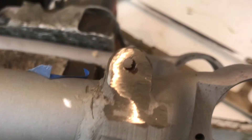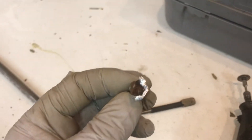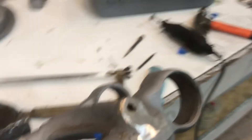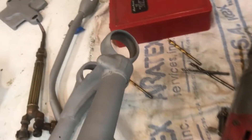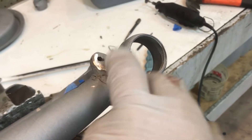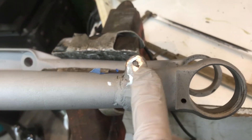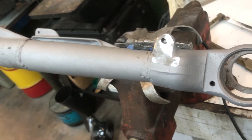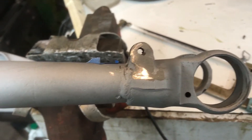There you have it — this is the end of the drill that was stuck in the casting. I went ahead and punched it out. And here was the bolt that was actually welded to the head. We got that ground down and it's basically in the proper shape — and I know it's the proper shape because I have the other swing arm sitting right here for reference. So what I'll do is clean this up, drill out all the rust in this hole, and then I'm just going to come in and braze this closed. Because this is nothing structural — it's just to fill it so we can shape it and paint it. We'll get this knocked out, get it all brazed up, and it'll be just as good as new.